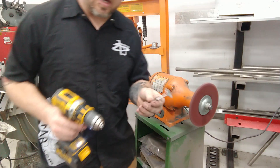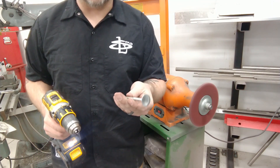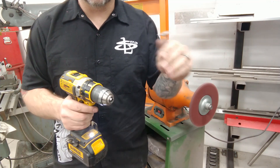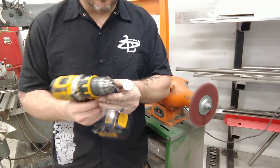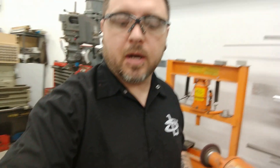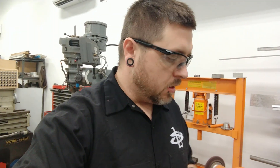You guys can do this with just some sandpaper and some scotch brite if you don't have a buffing wheel — just hold it in your drill and go after it. I would think about degreasing them a little better first and maybe getting some varnish remover to soak them in first, clean them real good, and then go about polishing them, or else they'll just gum up a bunch of sandpaper.